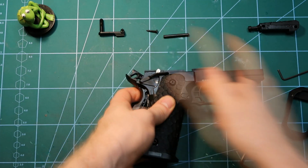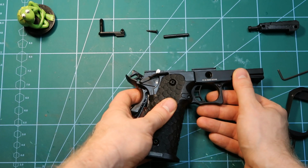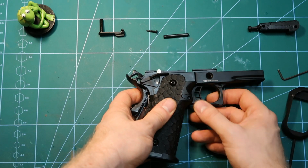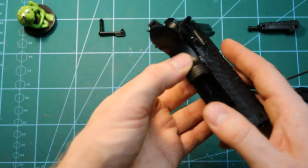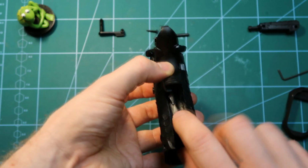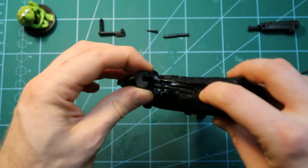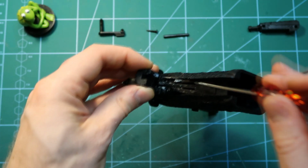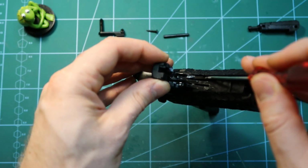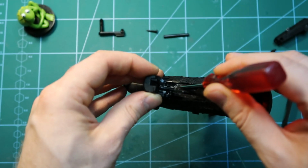And the third one cuts into the plastic, so I don't want to wear out the plastic part unnecessarily, and for this reason I will not be putting it in yet. It's not necessary for the test if everything is fine. So then if it is assembled, let's press in this leaf spring. Let's make sure here that everything is fine. So you can see that this arm of the spring goes over the silver part here.